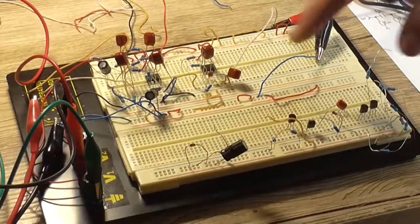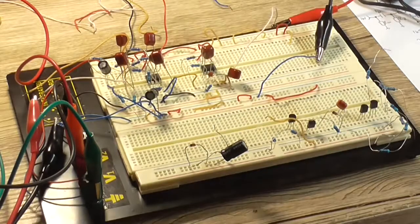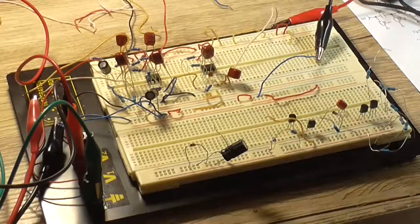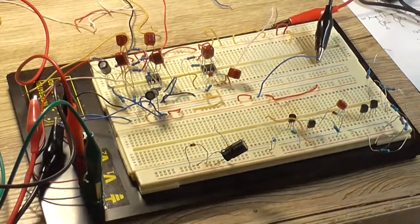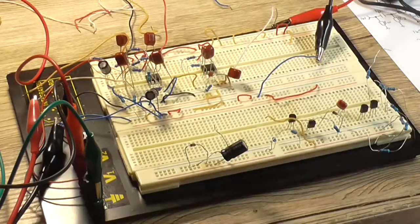Okay, so now I've got the summing amplifier connected up via two 47k mixing resistors. As I said, I'm only going to do 2 channels in this demonstration. The final will have 4. But I've yet to work out the microphone. I'll do that later. But first I thought, well, let's actually get some mixing going on. Now there's no pot connected between the output of the input preamp and the summing amplifier on either channel, and I've only just got one connected for demonstration.